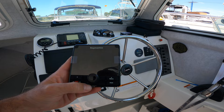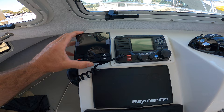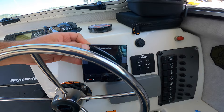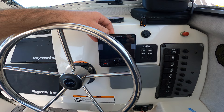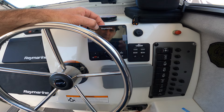First thing I'm going to do is try to see where I can mount this. Unfortunately it's going to be too big right here because of where I had to mount my VHF. I kind of want it a little closer to the throttle because with this system you actually have to hit standby. I think I'm going to put it right in here. I'll have to pull the steering wheel, but it'll be close to the throttle so I can hit standby, set the course, whatever. I'm primarily going to be running this from the MFD anyway.